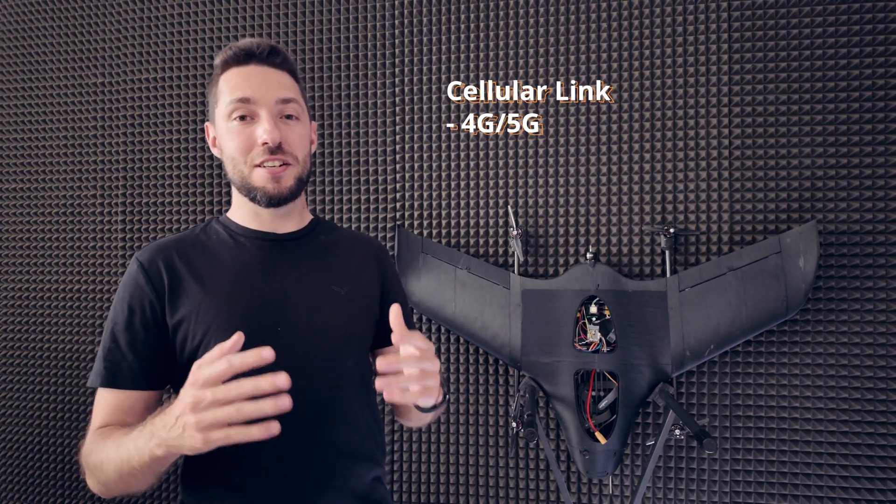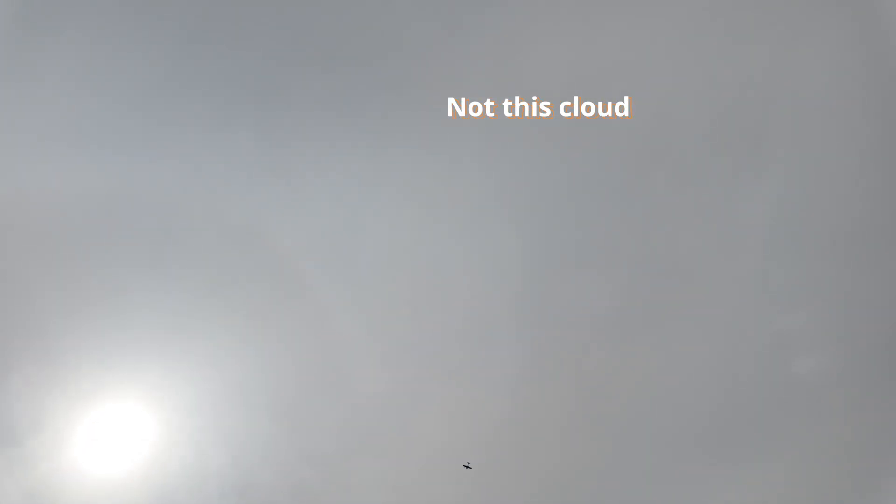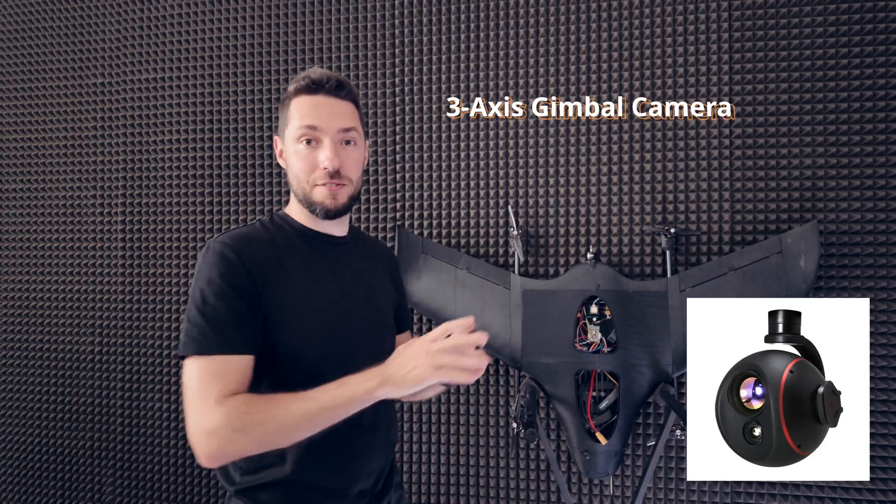Finally, the one I am most excited about is the cloud link. This is essentially a 4G or 5G cellular modem antenna on the aircraft, which can transmit and receive data via the cloud. That cloud data can then be accessed in real time by any cloud station anywhere on the globe. Unlike radio control, this solution works way beyond visual line of sight, as long as there's good cellular reception, which is usually up to 120 meters in altitude. Imagine pairing this cloud link with a three-axis gimbal that can look in any direction — you can essentially see anything from anywhere. Of course, there are legal implications, but this would be used for commercial or government use cases with proper licensing.